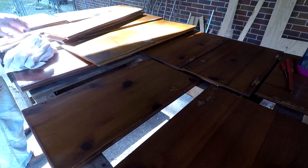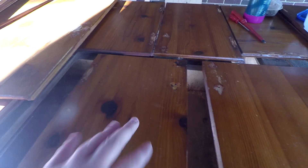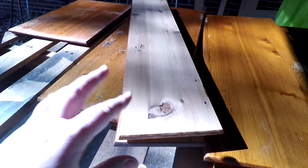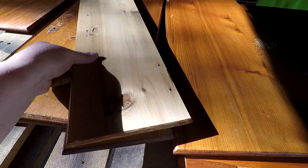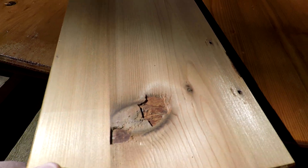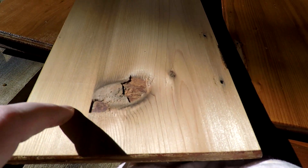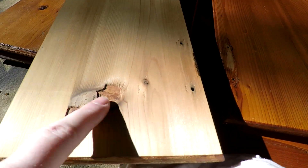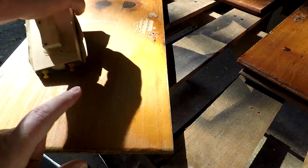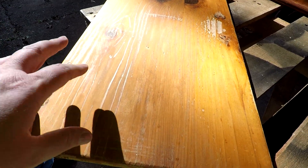Now it's time to start on the doors. I had this brilliant idea to run them through the planer real quick just to knock all that crudiness off — not a good idea, don't do it. You see all those knot holes? We ran two of them through the planer and it messed them up bad, so we didn't do any more. We learned our lesson quickly, but we needed those two to be the same thickness since they're the only ones on that wall. So we ended up just deciding to sand them.